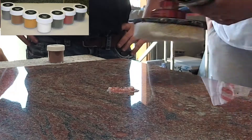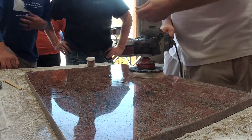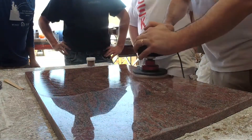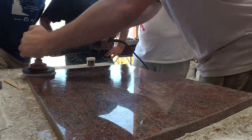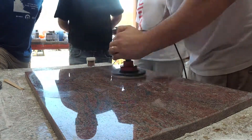You would do this type of thing for several reasons. First, MB Stonecare has discontinued the MB20 black, so using a black tint is a must on darker materials like Ubatuba and some others, where the white paste can get impacted into the pits of the stone and can be impossible to get out without masking it with color enhancers and things like that, which are very temporary.